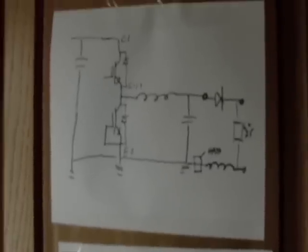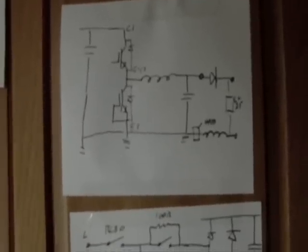Now there are two things then that I have to sense. I have to sense voltage across my battery terminals, and I have to sense current that passes through the charging circuit. Now I'm going to just try to do the power stage today, and if anybody has sufficient interest, I will do a little bit on the current and voltage sensing stages. I don't want to bore everybody to tears, so what I'm going to do is pop the cover off the charger here, and I will try to translate what we see on some of these diagrams into the physical parts that make up the charger.